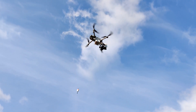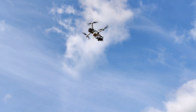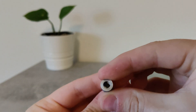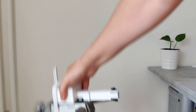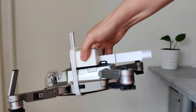This time I started to test the reeling procedure and it seems to be able to handle the float, hook, and weight just fine. But when stress testing it with maximum load, the whole device loosened from the drone at 600 to 700 grams of extra weight and fell to the ground. This caused the mini rod to break apart from the structure and the motor mount to snap. However, there's a solution. Let's give it the good old shake and twist test — and since everything else seems to be working fine, it's time to try it out for real over water.